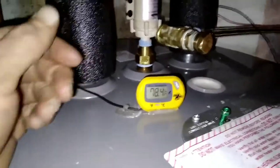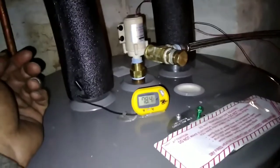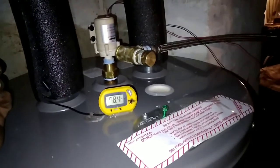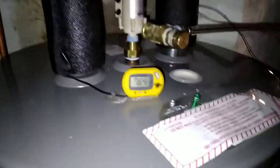Once I get over 90, it really climbs. When this outgoing water goes into the coil and comes back into the tank, as this gets warmer and warmer, it progressively speeds up its recovery time. Like, we're at 15 degrees in about 40 minutes, but we're starting from a cold tank. So yeah, we'll check back when she's at about 120, just to ensure that we have no leaks, and I'm literally just gonna hang out down here and listen to this thing. I'm gonna let that fan go, dry the little bit of moisture left behind the tank.